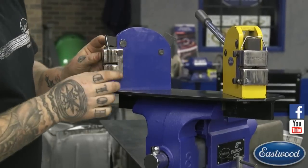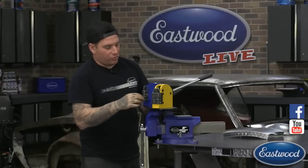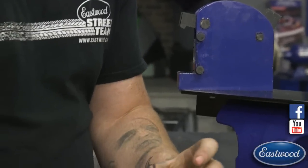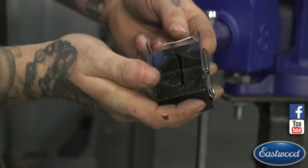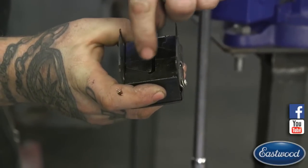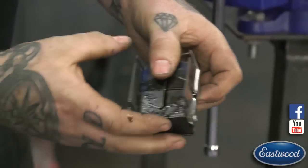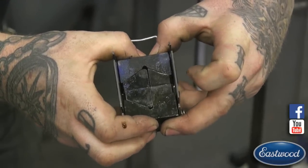But if you're trying to save a little bit of cash, we do offer one body with 2 jaws, which leaves a little more work to swap. What you can do is pull these jaws out like this, and I'm going to show you guys the inner workings. Up here our lever is grabbing onto there, and when it pushes down, it's got these sloped blocks that, as we pull on it, grab and pull together. Let me do it again. As it's pushing down, it kind of shows you what it does.